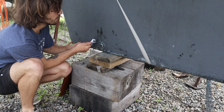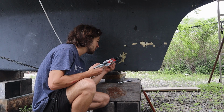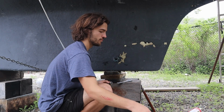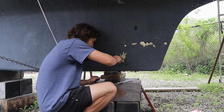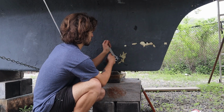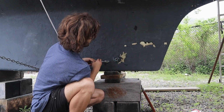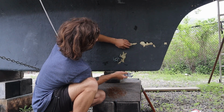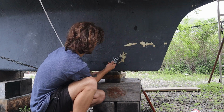So I'd like to stop it from leaking on our bed. So I'm just going to put some window sealant around it and hope that that works. And I have to do the same thing with our windlass. I bedded it down, but I would like to run a ring around and make that like a nice little fillet. So it's just one more barrier to not get water in, which would be sweet considering our deck is already rotten.